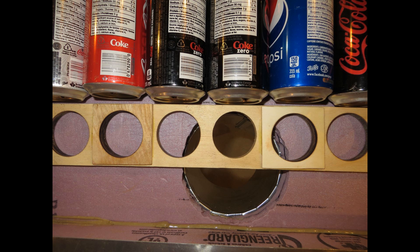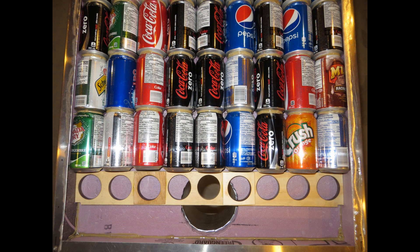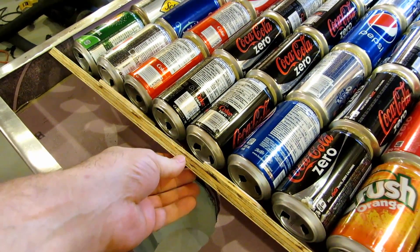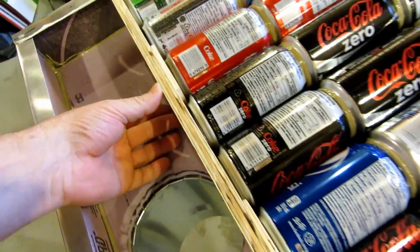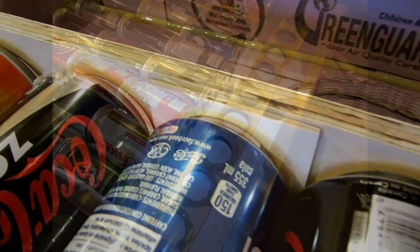The installation of the intake manifold took even more fiddling. Even though previously I had talked about the importance of ensuring each solar air tube was the same length, I still noticed slight variations in length on a stack of 17 cans. I addressed this by manufacturing two plywood shims — one is 1/8th of an inch and one is 1/16th of an inch. This ensured all 9 tubes would be snug against the intake manifold.